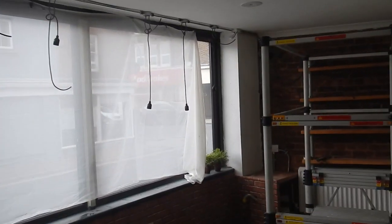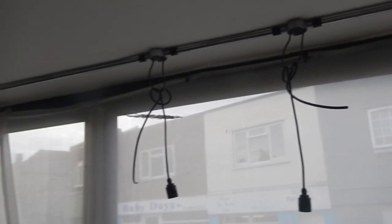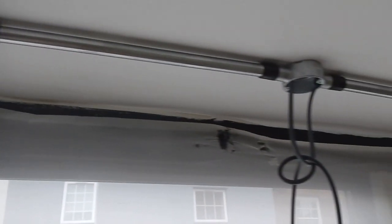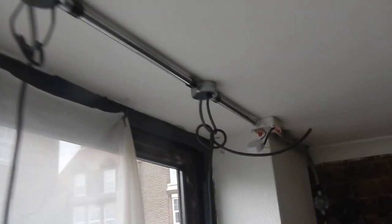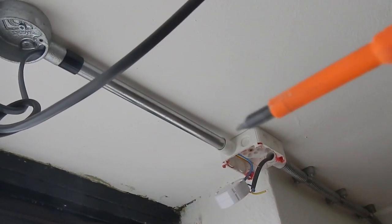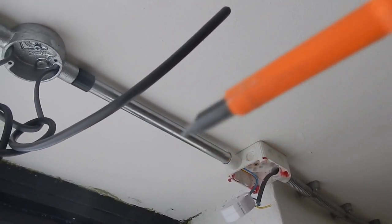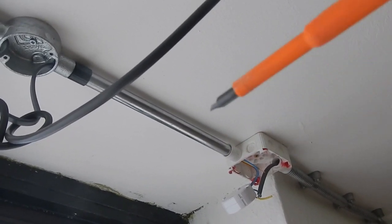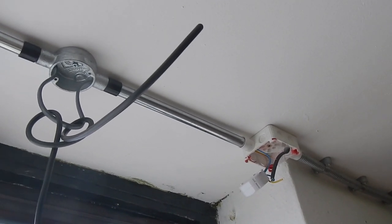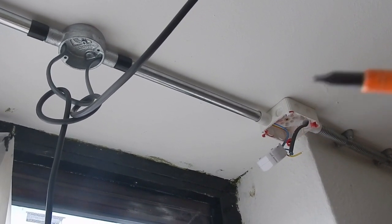The thing I've got to do still over here is connect these up the right length, put the dome lids onto these through boxes, and what we're going to do up here is insert the radio switch, and just here we're going to break this piece of conduit here, put another enclosure in for a dimmer. After the radio switch, there'll be a dimmer so that you can set the luminance of the lamps. You can set the luminance and then turn it on via the radio switch from the bar.